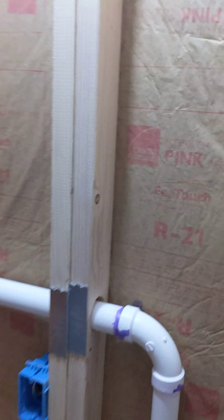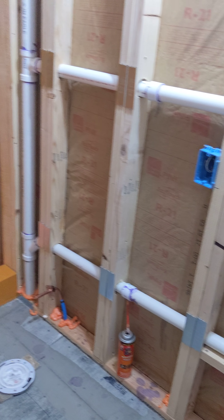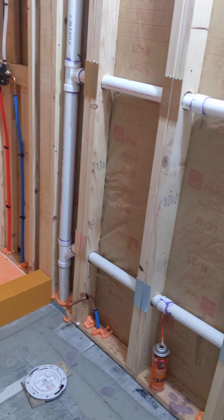That's the toilet water supply and the hot and cold for the sink. I also want to point out that this wall is built on top of an existing 2x6 wall — the 2x6 wall behind here is the load-bearing wall. This wall was just built for the plumbing, for the wet wall. The 2x6 wall sits on top of a beam in the basement, so I couldn't drill through that, so I built this fake wall for all the plumbing to go in and out of.